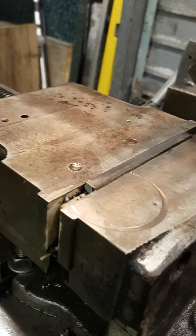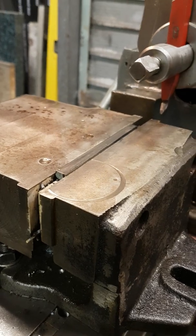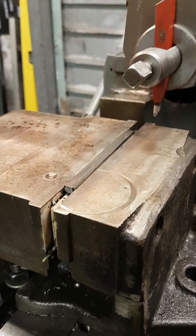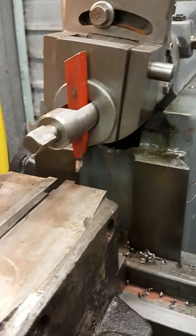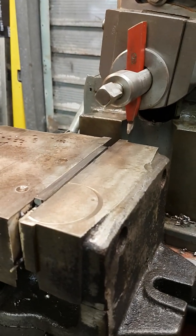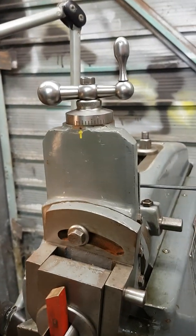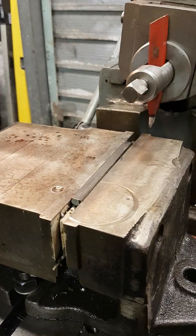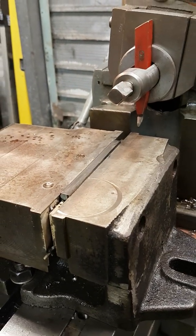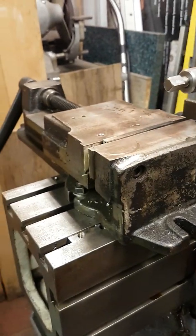It's about six millimeters in diameter. I've already had a few goes as you can see, so I kind of know what we're in for. I've got an old carbide tool in the tool post, something that I'm never going to use anyway, and we're taking about a millimetre's worth of cut on the top there. If you're not familiar with a ferrocerium rod just sit tight - you'll soon see. So let's crank her up.